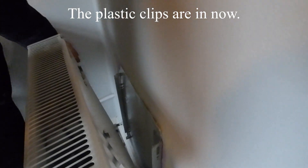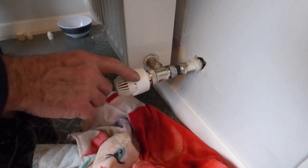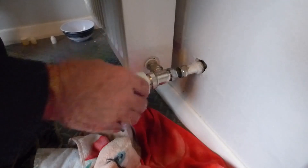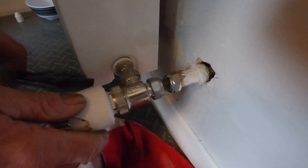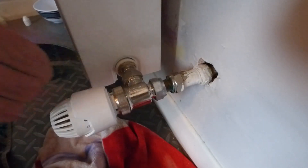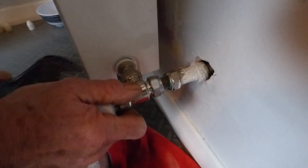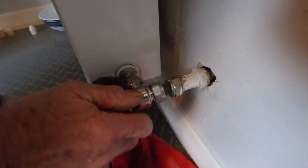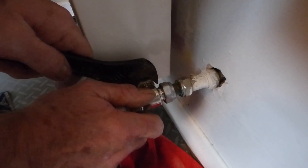Here we go — I like to line it up at the back, get it about right, and hook it over. I've put the thermostatic head on to shut off the valve while fitting. Once the rad goes on, the connections pop in pretty easily — there's plenty of leeway around the pipe holes. Now tighten up the connections. On this new end you just hold the body with your right hand, no need to go mad. If you're using an old radiator valve putting it back, you may need to give it a lot more and go back to the old method of holding against it with the footprint pliers.